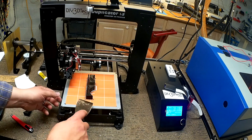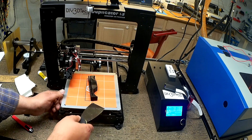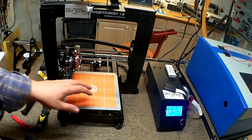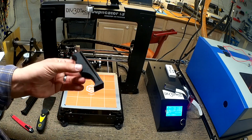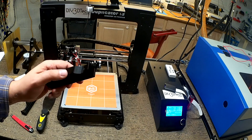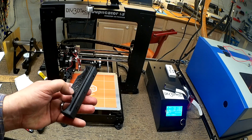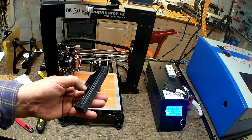One of the big questions you may be asking: what is this for? As I attempt to pry it from the bed here — if you watched my prior videos on preparing the bed with alcohol, this was the result of that and it stuck pretty well. Also, I'm using the 0.3 nozzle and I'm getting a lot of artifacting, what I'm calling artifacting, or basically cold extrusion.